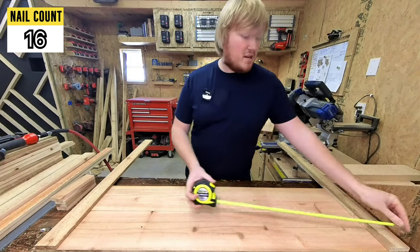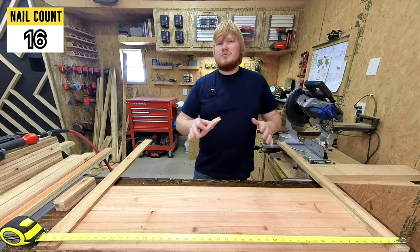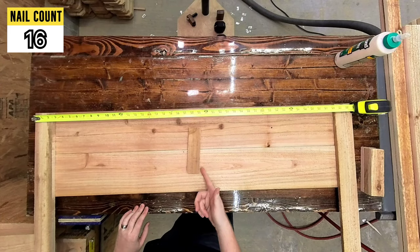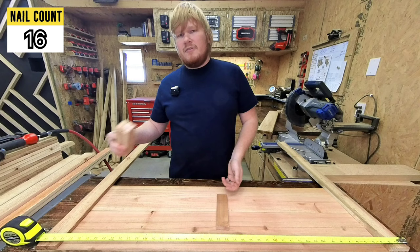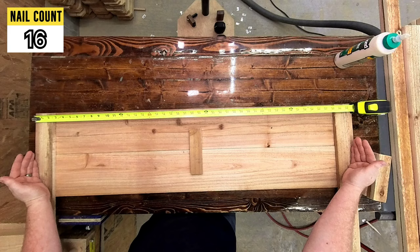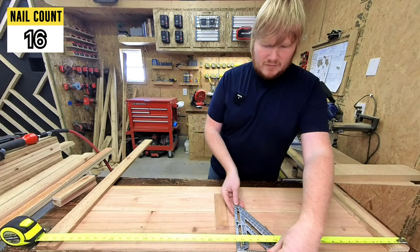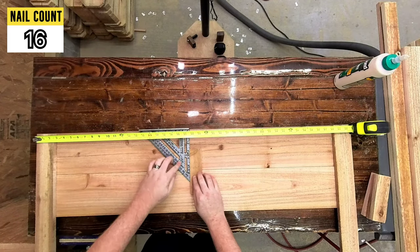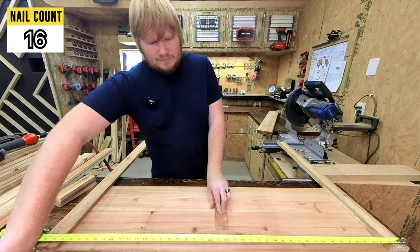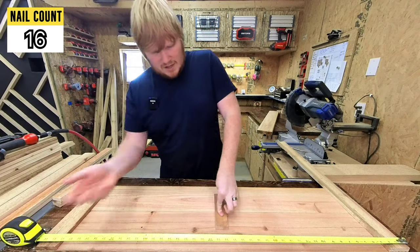So this is where I was messing up earlier in the season. This 45-inch-long piece is actually supposed to go on the inside of the box so you don't see it in the dirt and your outside looks nice and flush. But I did mess up and put it on the outside where the legs were. So now I just put one on the inside and the outside — no one would know any different. Now 45 inches, 22 and a half is my center. I just get it looking like it's supposed to be there, take my handy dandy square, eyeball to 22 and a half, tip them up, put a little bit of glue, squish them back down, then put three nails into each of the tops and the bottom.